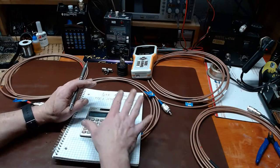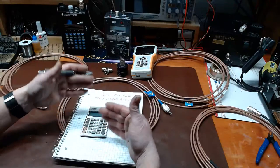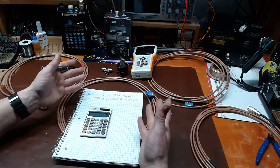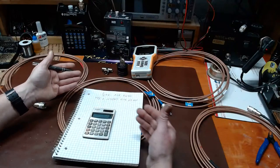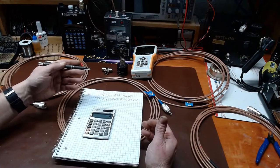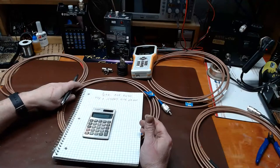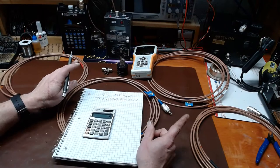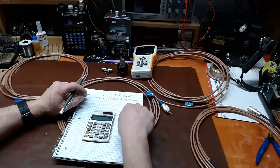The reason why is most of these meters, that's typically what they lay down on, is typically like 400 instead of 405 that we normally would use for channel 40. But instead of doing it in the center of the band, these are actually going to be made at channel 40. It has to do with a particular test and a particular setup that I'm actually going to wind up using these in when I've got these finished. So that's part of the reason why these lengths are going to be the length they are, or the reason why I'm tuning it for the specific frequency.